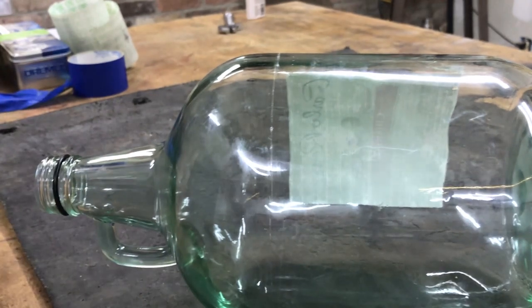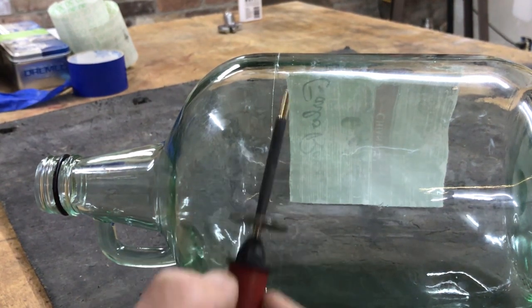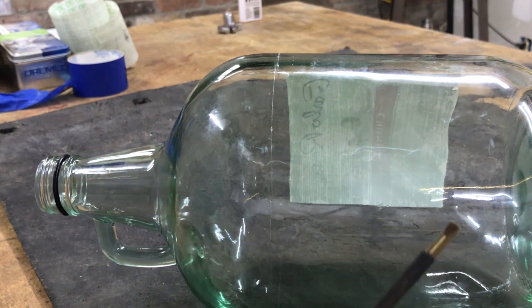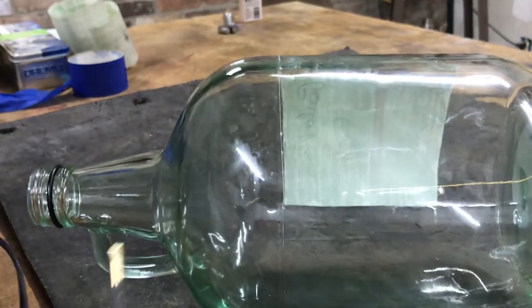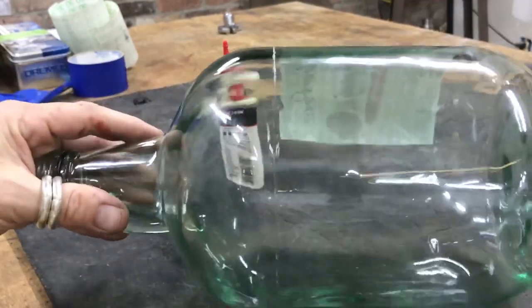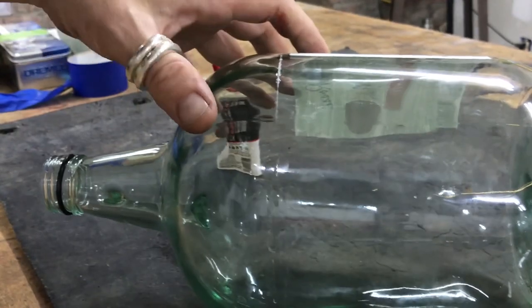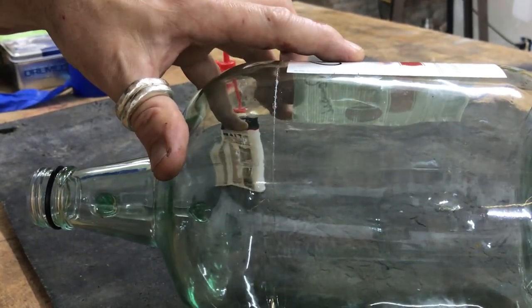We made contact on the other side, which is good. My thing today is I'm trying something new — I've been using a standard soldering iron to follow this crack. If you go back to my other video you can see what I've been doing, but the other tip is not wide-bladed like this; it's a fine point pencil tip. This is a nice wider blade. What I'm going to do today instead of going straight on the crack is apply a little oil on the crack itself to help focus the heat on the line. I'm going to let that drip down that gap and then press the wider tip into the line where I see the oil.